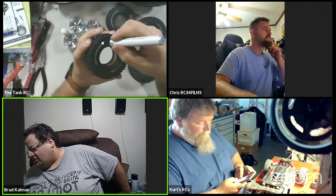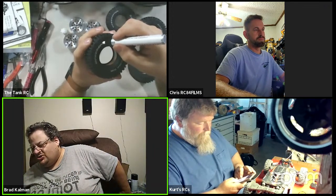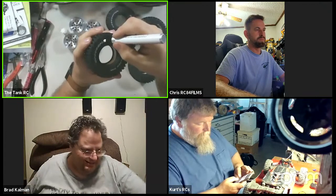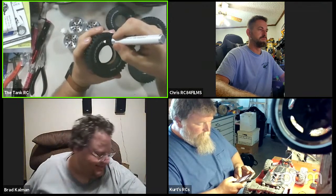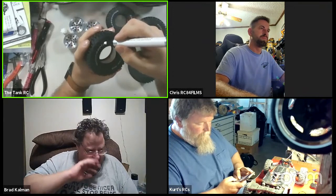I was in a rush this morning because, believe it or not, even at 5 and 3 and 2 amps, it takes forever to charge a nickel metal hydride at 3600 milliamp. It takes a while still. But you can charge those the day before. You don't have to charge them in the morning. And even if you leave it charged for a day or two, you're not going to kill the battery.